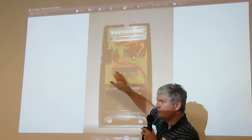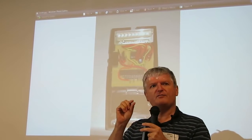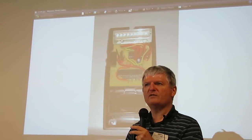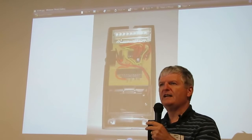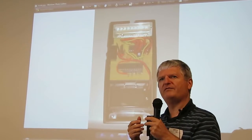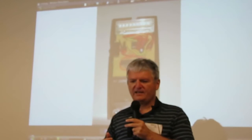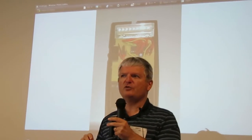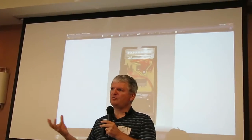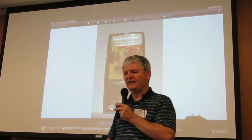Here's the processor. It's a Microchip PIC — they have a huge range of products, starting from eight pins, very simple ones, to 40 pins and more. The one I used was a mid-series, the 18F2550. It has 32K words of flash memory, some EEPROM, some RAM, and you can program it with an IDE called MPLAB X. It's available for download, free for the non-optimized version. If you buy a programmer for the chip, you plug it into your PC and you can flash the MCU very easily, then put it in the socket and try. It doesn't work — try again, debug, and so on.